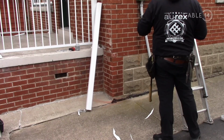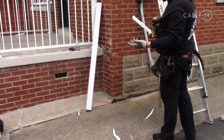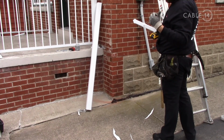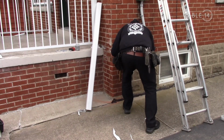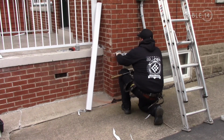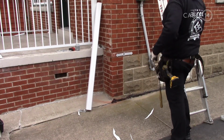Okay, so the strap's a little thin. So your washer strengthens it. The standard ones come thin, very thin gauge, even thinner than the trough material itself. So that's why we add that little bit to give it that support. Smart. And then you fasten. And as you can see, there's nothing. Wow. Nice.